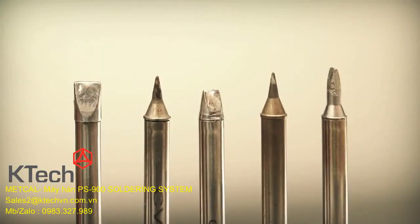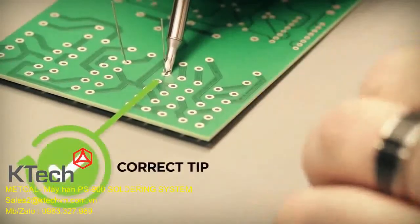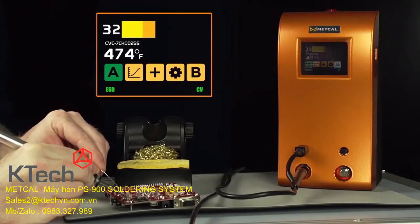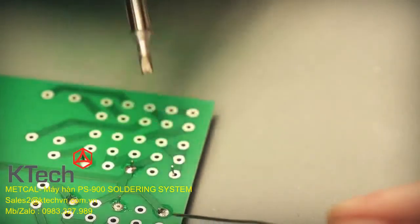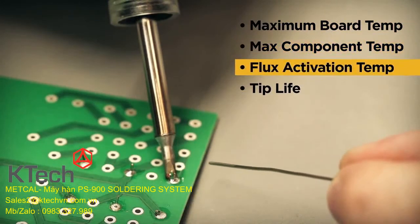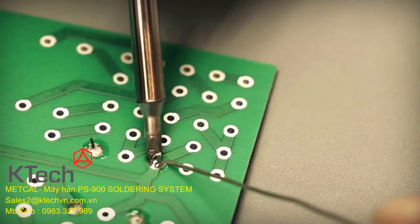Pick a solder tip geometry that maximizes contact with the connection. A flat, blunt tip will transfer more heat than a fine pointed tip — choosing the largest tip possible will improve performance and enhance tip life. Metcal's heating technology incorporates multiple alloys to achieve temperatures within the 500, 600, 700, 800, and 900 ranges. The specific metallurgical properties define the maximum temperature achievable by the heater, enabling the user to select the correct temperature range by balancing performance versus risk factors like maximum board or component temperature, flux activation temperature, and tip life. With basic solder training, proper tip geometry selection, and the right heater series, the user is now ready to solder using the Connection Validation system.